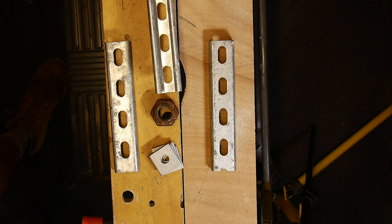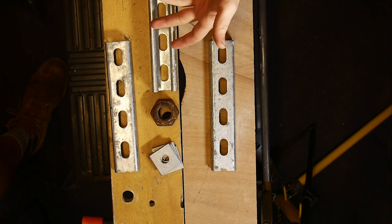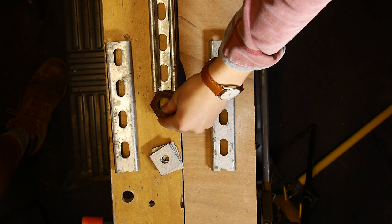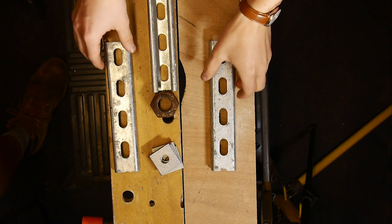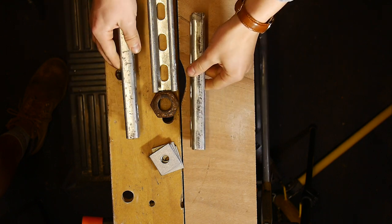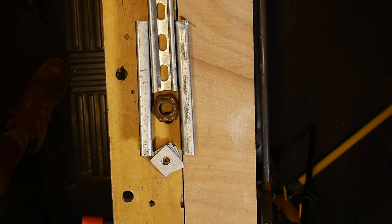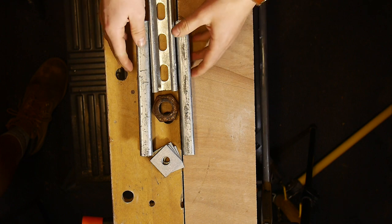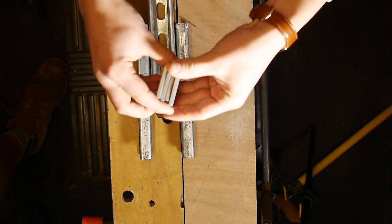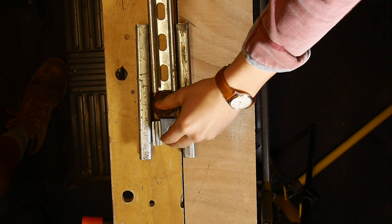The first piece of channel will be used as the handle. Fortunately, the width of the channel is exactly the same as the width of the nut, so the nut will just slot in at the top of the handle like that. Then we are using two further bits of channel that are slightly shorter, and they will be used on the sides of the spanner. Then at the top of the handle, we will drill through the metal and bolt it so it's secure. And finally, we will use about six spacers which will go over the top of the nut, which will box it off.